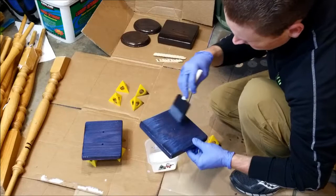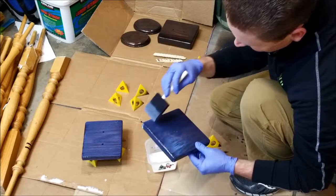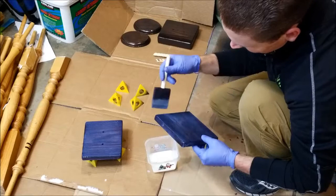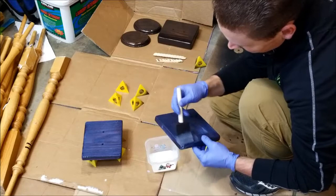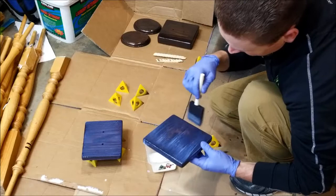That's the only reason you're sanding. If you sand too much, you'll take off the layers of polyurethane you've already put on, so don't over-sand. Just a very light sanding with fine grit sandpaper. It's going to make the surface look frosty and create little micro-scratches, which made me nervous because I already had a really nice finish after two coats — but when you put the final coat of polyurethane on, it looks fine. Those little scratches disappear as the new coat fills them in.